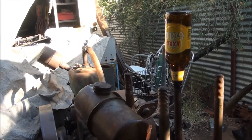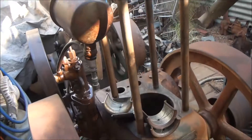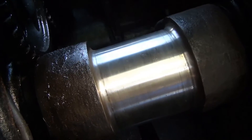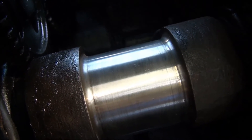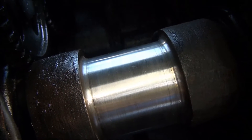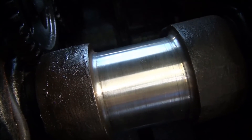Just a quick update on the progress of the CS Lister. I pulled the big-end bearing off and checked the bearing journal — it looks pretty good. After a quick cleanup and measure, it's two and a half inches with no sign of any major wear, which is good, so we'll be using standard bearings.